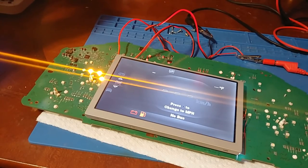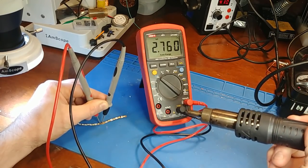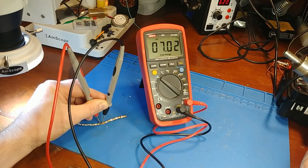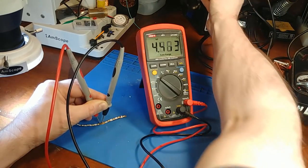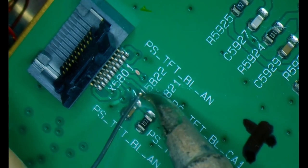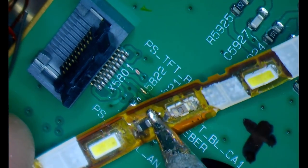There's a mystery component on the LED strip tied to the two small middle tracks on the ribbon wire — it appears to be a temperature sensor. I was hoping that putting the temperature sensor back in the circuit would be what it needed to turn back on, but in the end it didn't make any difference. The transistor still didn't turn on even with the temperature sensor reinstalled.